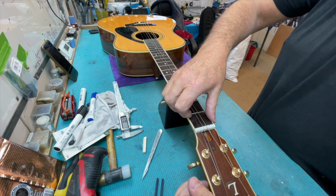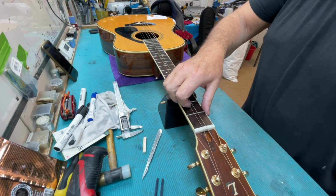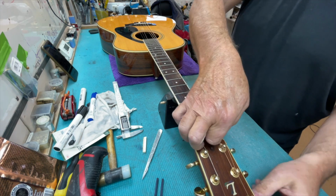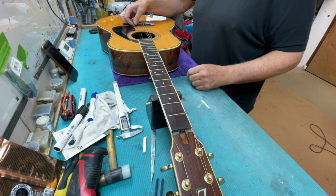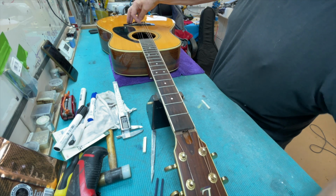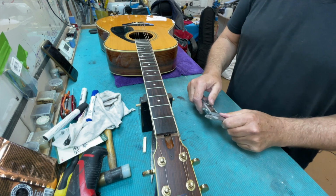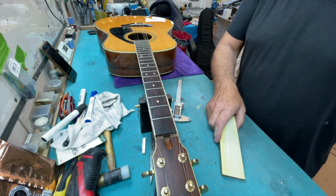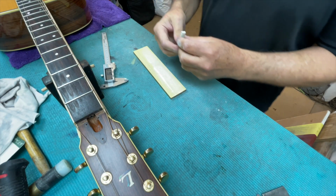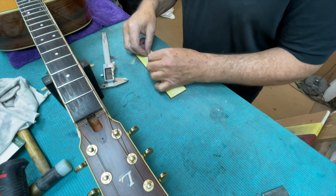Fiddly, fiddly. Now, I'm looking at the other end of things up there, knowing that I've got a tiny bit more leeway on that saddle at the other end, and my wickedness is thinking, should I take a little bit more off there? And you're saying, don't, Sam, do not do it. And you're right, I won't do it. Right, so now I have to go to 7.94 and 6.97 with more off the bass side than the treble side, whilst keeping it flat. And we've got no marks on here because we're not following a line. We are following just the measurements.